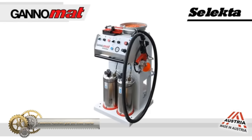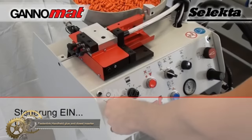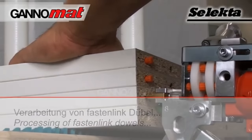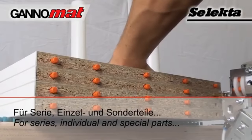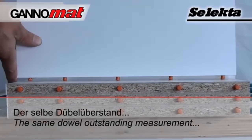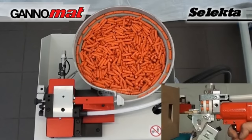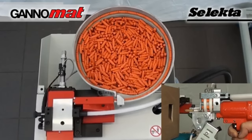The FastenLink Handheld Glue and Dowel Inserter is a machine from Gana that inserts dowels and glue simultaneously using a gun. It is designed for professional and efficient dowel processing in furniture and framework. The machine provides a consistently accurate projection of the dowel length as well as a constant and correct amount of glue. The gluing system is easy to clean with EasyClean, the automatic cleaning program. The machine automatically rejects dowels with incorrect diameters and lengths using AutoDL Selector. The glue dowel inserting gun is recoil-free, extra light, and comfortable, making it a great time-saver compared to using a squeeze glue bottle and hammer.